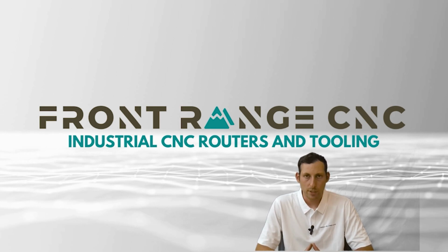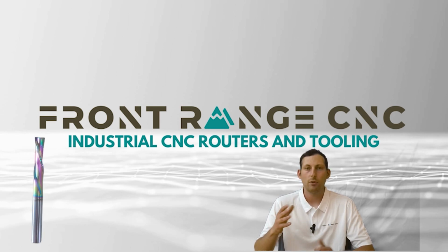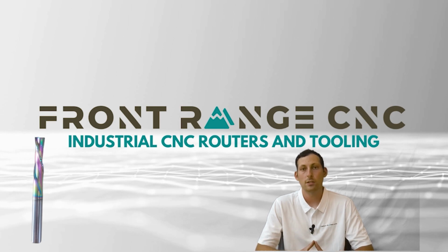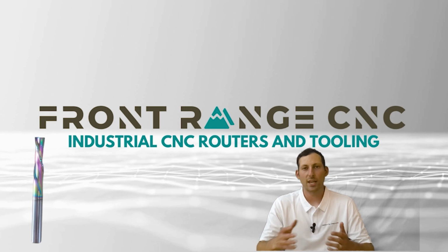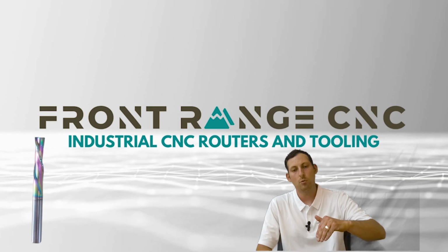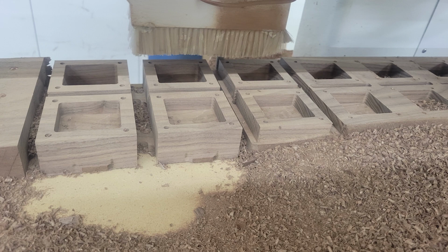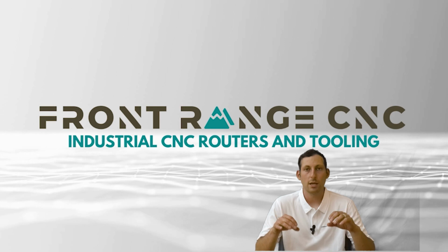A down flute bit, that style is good at keeping your top edge clean. Think about if you've cut plywood on a table saw and you put a piece of tape on the edge and then you cut through the tape, a down flute bit theoretically is tearing that top piece inward and preventing tear out. A down flute bit typically would keep your chips and your material with applying pressure downward.